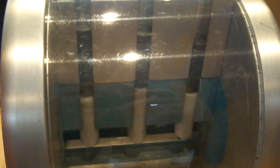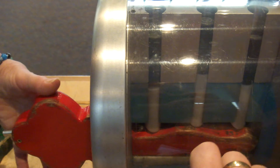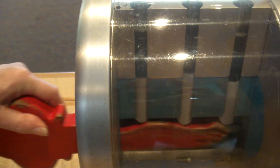And that's why the key — or the plug — won't turn now. This is the wrong key. These wooden high security keys — see how they're not level here at the top. Right there, so now the plug won't turn. That's what happens when you put the wrong key in your lock — kind of an interesting visualization.